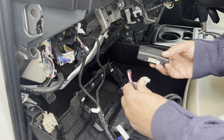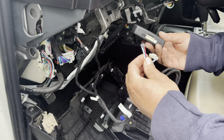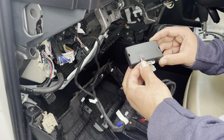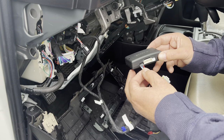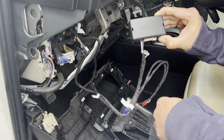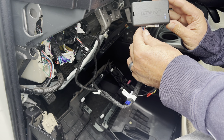Programming is a very important part. Your small black connector is the only one that we will connect at this time. Before we connect it, we're going to push the push button down — because if you just connect it, it will alternate red, yellow, blue. We don't want that. So we're going to hold this button down, push the connector in, and it's going to alternate between the red, yellow, blue. Once it gets to the blue only, you release — and you can see it's blue lit only.